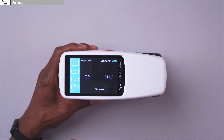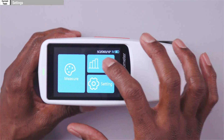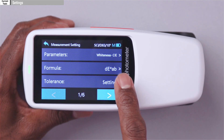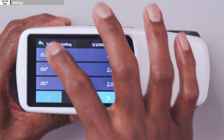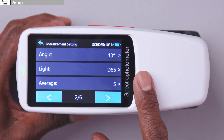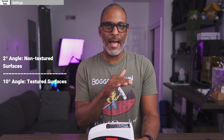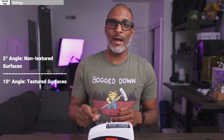Now that we have a whiteness calibration, let me go over a couple of settings I use. You can see the CIE whiteness setting — that's what I use for getting the whiteness measurement from e-ink tablets. In the settings you can pick parameters, and it says whiteness CIE — that's the parameter set to gauge whiteness of whatever surface I'm measuring. The only other measurement I change is the angle: I change it from 2 degrees to 10 degrees, because e-ink surfaces usually have a writing texture. Light is set to D65, which is daylight 65, a common light standard for these devices.